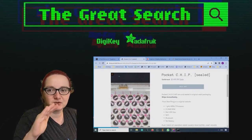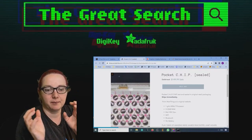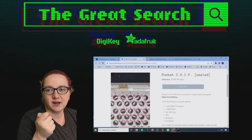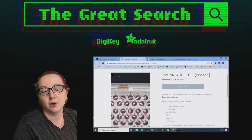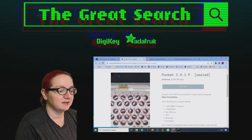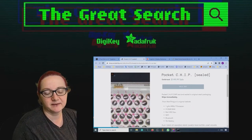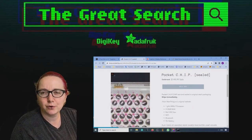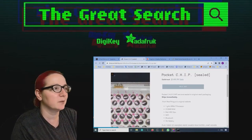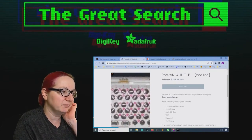It has a much lower height — you don't have the mechanics of a switch with pads and then above it an actuator. Your finger is the actuator. And then of course you can put an overlay, like a vinyl overlay, that has a legend on it to label the buttons. I have these low-cost remote controls, and when I was a kid I had a pocket calculator with dome switches — an inexpensive, easy way to add a lot of buttons.